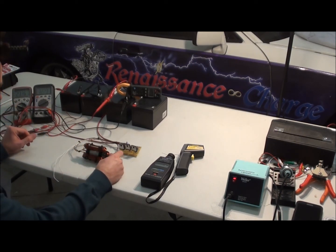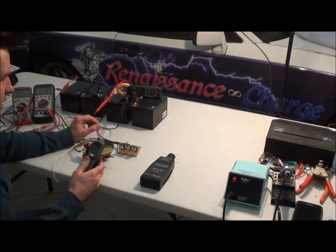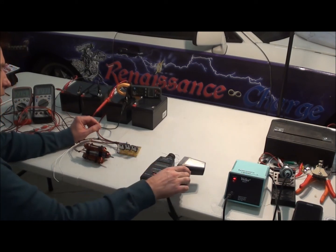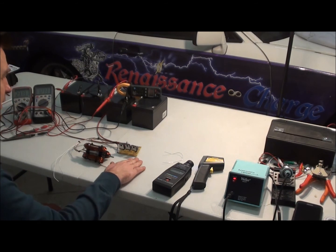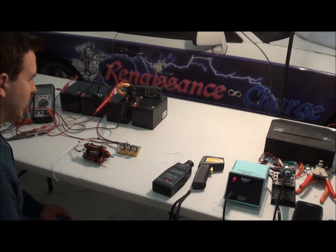You can see the charging range and the amp draw. We want to put a heat sink on here because if we push more than one amp, all these transistors are going to get hot. As you can see, 170 Fahrenheit is getting up there and starting to affect transistor performance. It'll still function fine up to over 200 degrees, but you still want a heat sink on there. I didn't put one on because I knew I'd be blowing out some of these transistors under the experiments we're running.